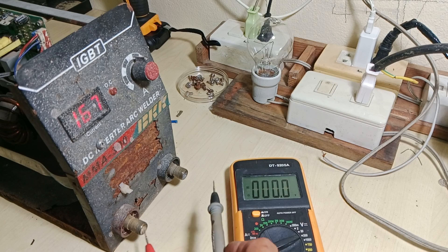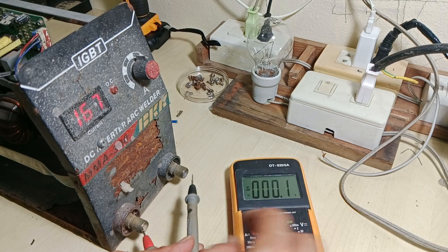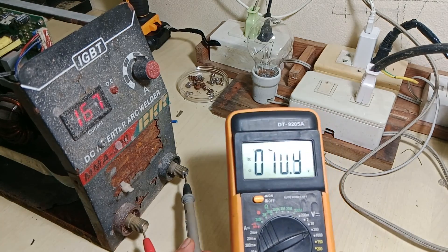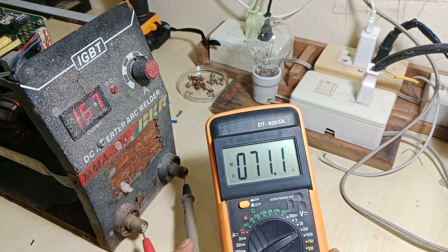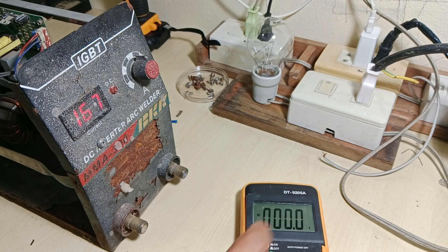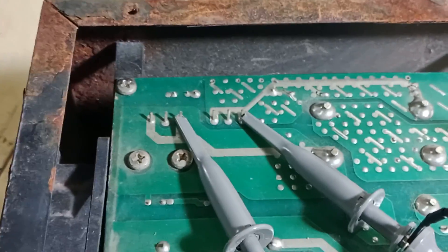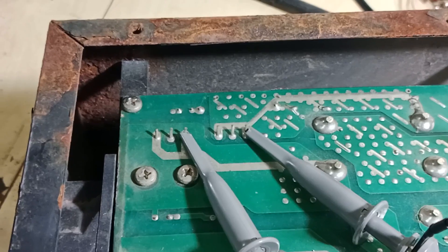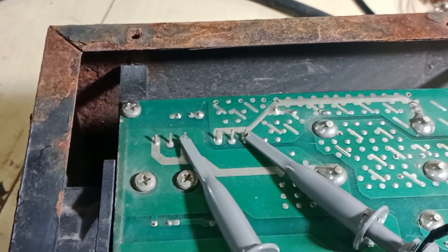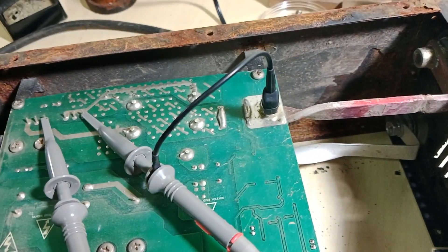Without the extra fan, the welding machine seems to work but the OCV, or open circuit voltage, is about 70 volts which is a bit too high. I will probe the output side with an oscilloscope and show you what's wrong. I put the two probes of the oscilloscope to the anode of the two fast recovery diodes as shown, and we can see the AC output just before rectification.